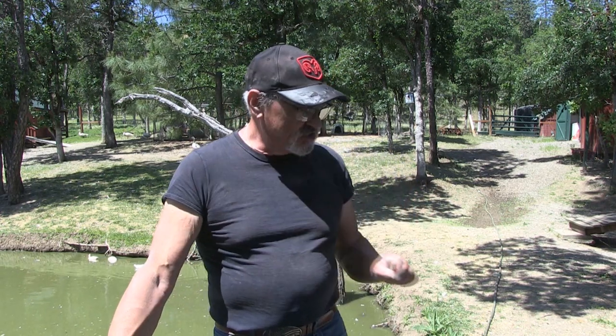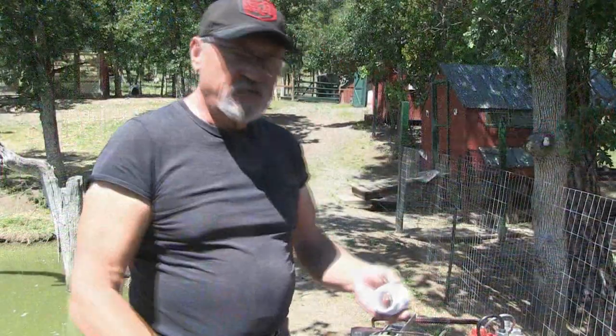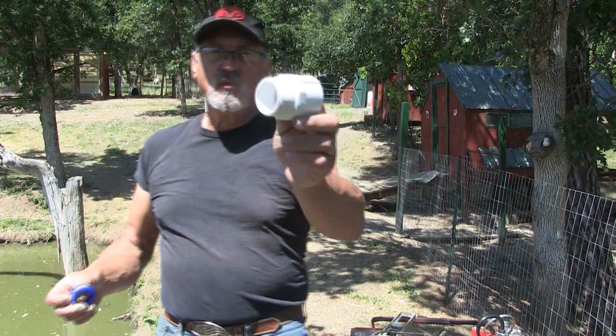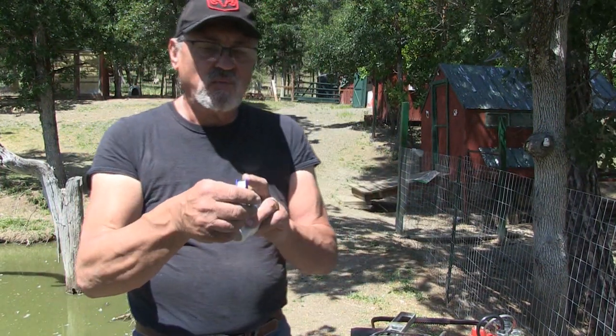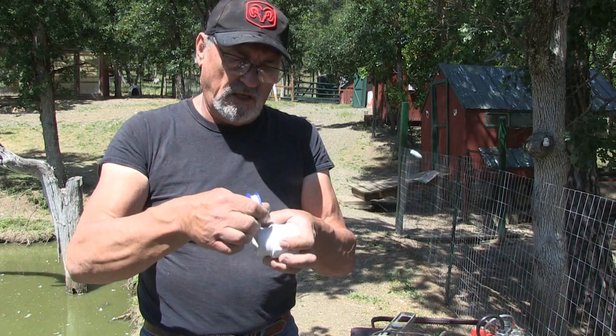I had to get the sand filter system set up first because now I've got to get in the water and attach all my fittings to the pump. Let's attach the fittings to the pump first. Inch and a half threaded on one end, and we'll glue the pipe in on the other end. But again, we need the Teflon tape.